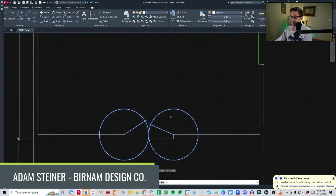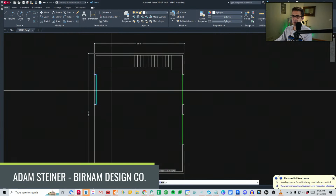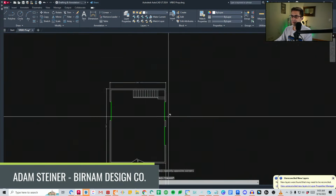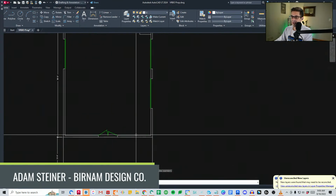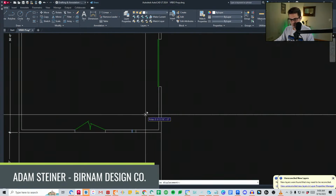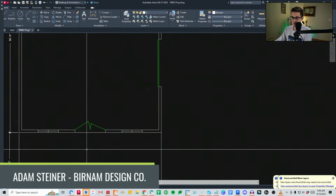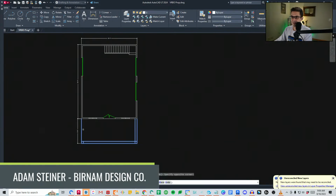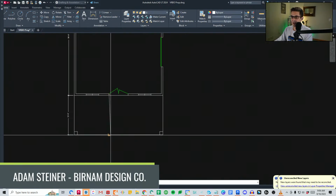We might also want to show an auxiliary garage door on the backside here so you can pull through, like if you have a boat or something. That can be really sweet. Just park it, untrailer it. Okay, and then probably have a couple windows. They probably don't need to be so big. I'm showing double 24-inch windows, maybe like 24 by 48. We'll have some columns on the main floor here holding up that porch area. Most likely there'd be mid-span columns here as well.